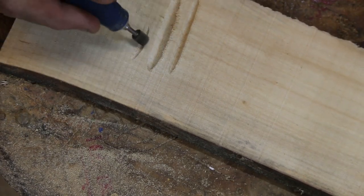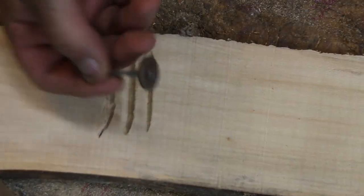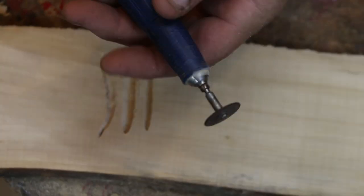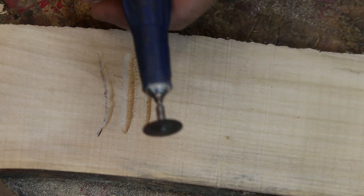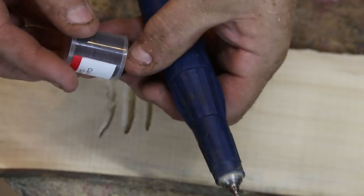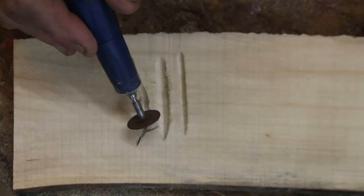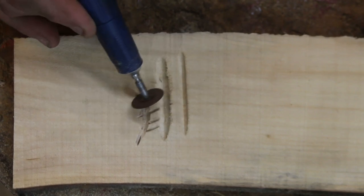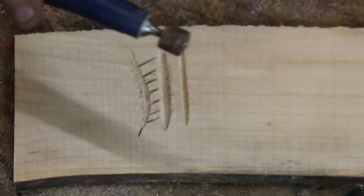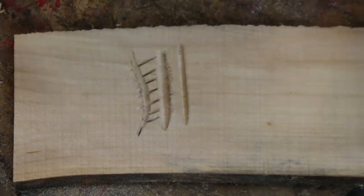There's a bit that came right off the shelf at the store for a Dremel — a square cut. I go ahead and buy those; they're cheap, three to five bucks. That's a Dremel cutoff wheel. They make diamond cutoff wheels but those have a tendency to bend, so I try to stay away from them. This is where I use safety glasses. I always have a stack of these because they self-destruct. I'll run those around five, which is half speed — about 20,000 RPM. They're probably not rated for over ten thousand, but that's a Dremel attachment. You can use a Dremel for power carving — it's just a little bulky in your hand.